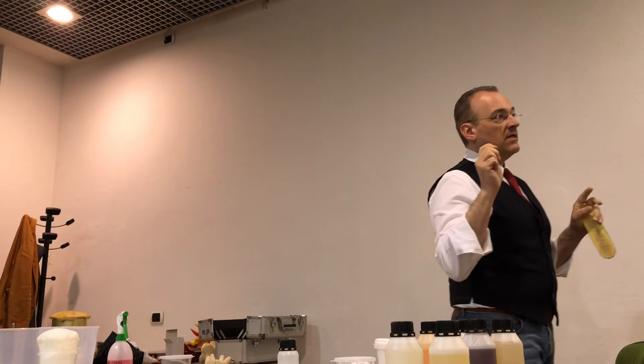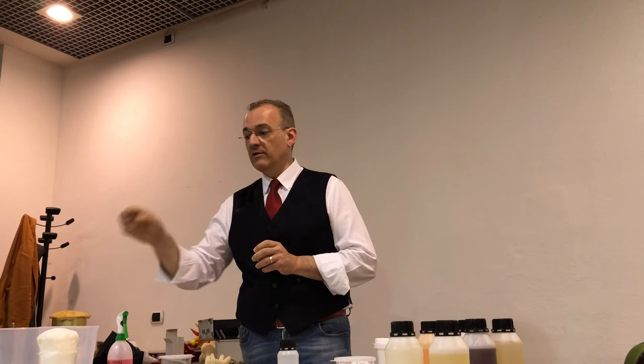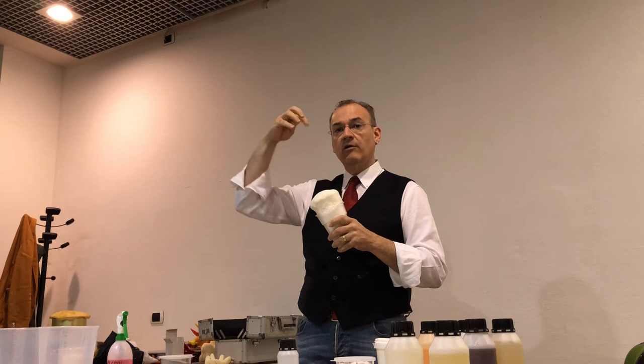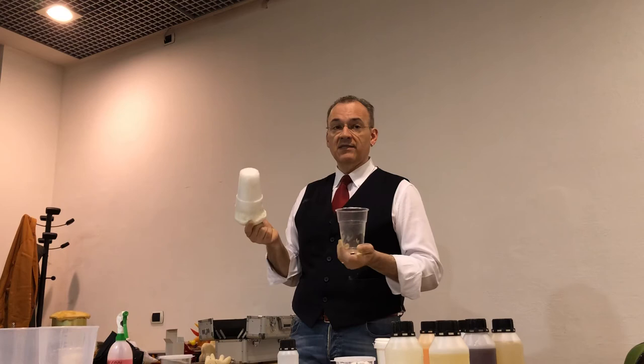Something else that is important, except this one, there are not other big issues. Pressure, and you cannot control it. A good idea when you use these things is that you take a needle, a big needle, and on the material you are making, make a lot of holes. So the inside gases that are not completely set, that are trapped inside, can go out. And you help it to set. And usually it's better to let it set for at least 2-3 days before starting to use it.